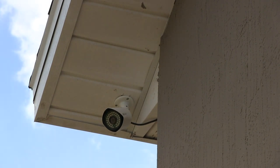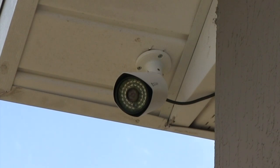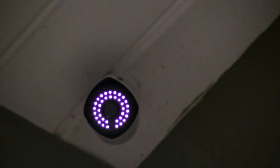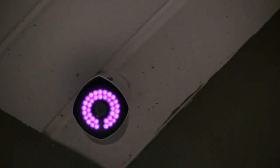The system is well built. Both the camera and NVR have a solid build quality that makes them feel tough. The cameras have a decent weight to them and are housed in a metal housing. This ensures that the camera is completely protected from outside elements while the weight keeps the camera stable if mounted somewhere unstable, such as the bottom of your soffit. The infrared light provides adequate lighting approximately 65 feet in the darkest area of your home. Each camera supports POE, so one cable is all you need — but keep in mind your NVR also needs to support POE if you buy the cameras and NVR separately.